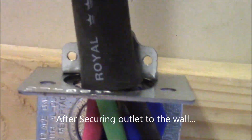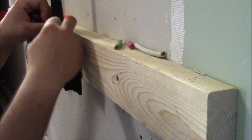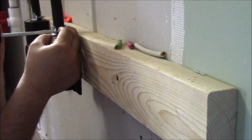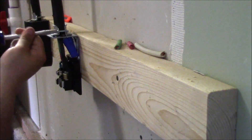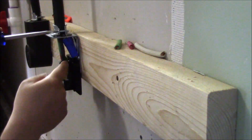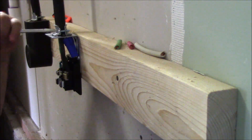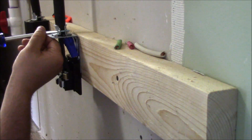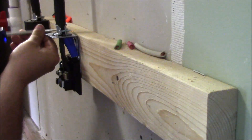One important note: the cable's insulated sheathing needs to be inside the box. These two screws hold what's called a strain relief — it's called a relief basically because if there's any tension in the cable from being pulled, it takes all that stress here so it's not pulling any of the cable out of the terminals. You don't have to crank down extra hard on it, but you definitely don't want to push it down so much that it damages the cables or the wires inside.